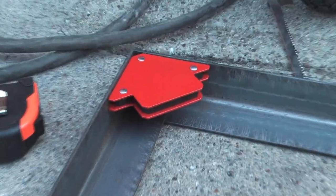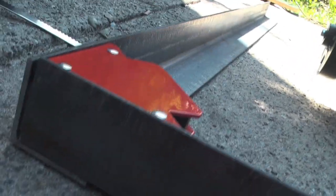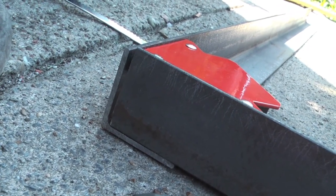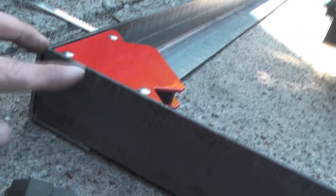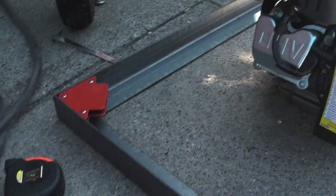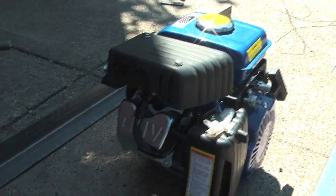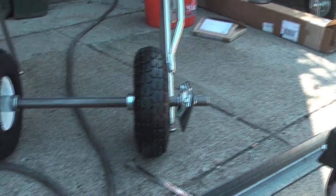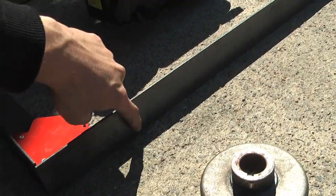The back piece is held in with welding magnets. I tried to notch a little bit of the bottom to get around the radius and get tighter in there, but I'll weld all through here and up the front of the frame and fill in a bit — it'll be super strong. It's two-inch angle iron. Then I'll figure out how to mount the brackets for the bearings. For the rear axle I'm gonna have to take a V out of it, but when I weld the bracket back in with the V it'll give most of its strength back.